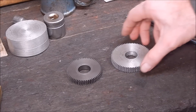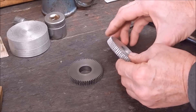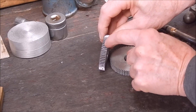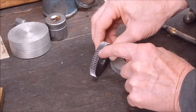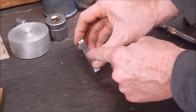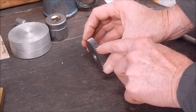Here are the two gears I had to replace. This is the aluminium one — you can see the teeth are mangled and torn. On this one, even where it looks okay, you've got chips here and there, all through there. The swarf fed itself through the gears. You could reuse it, but I wouldn't want to because it's only going to chew up the other gear over time, and you've only got about four-fifths of the teeth on most of them.